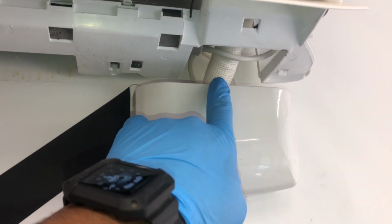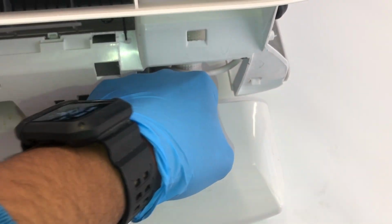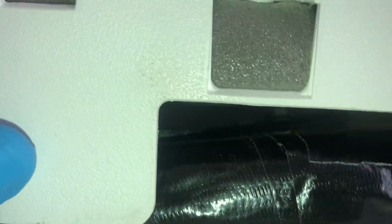The green hose comes from our pump, which is here. We have a condensation pump that pumps water out through this line, which is 3/8, and it connects to that 1/4 inch tubing. So technically the technician who installed this didn't install it correctly. After they Mickey Mouse it, we have water, and that isn't fun.